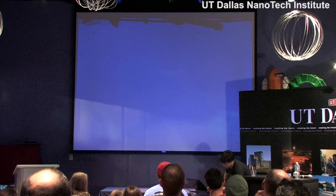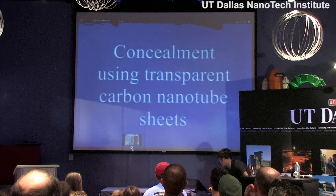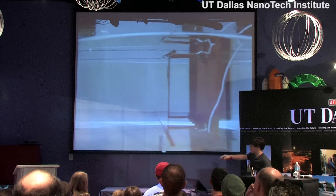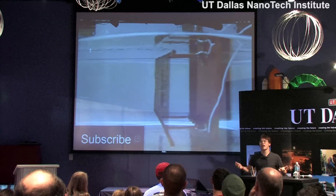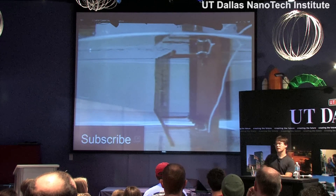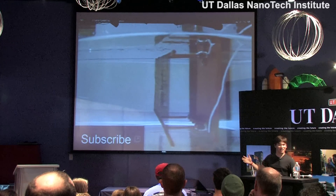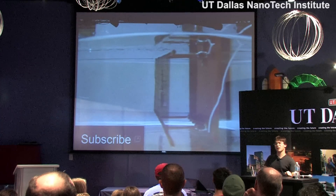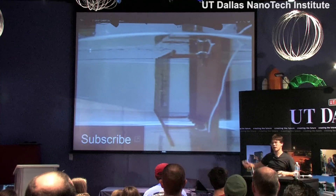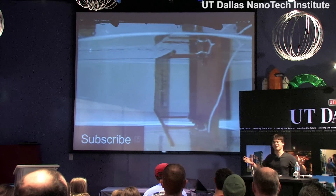We can create these sheets of nanotubes with very special properties. What you see in the video is a carbon nanotube sheet — you can see through it, that's the first thing that makes it cool. The second thing is it's electrically conductive, so you can pass electricity through it and it can heat up. What we do is heat and cool it very quickly. When you heat air, it expands — and just as you can take a cone and move it back and forth to create waves, you can do the same thing if you make air expand and contract. We feed a wave into the nanotube speaker, and by heating and cooling it very quickly, we heat and cool the air around it, and you hear those as sound waves.